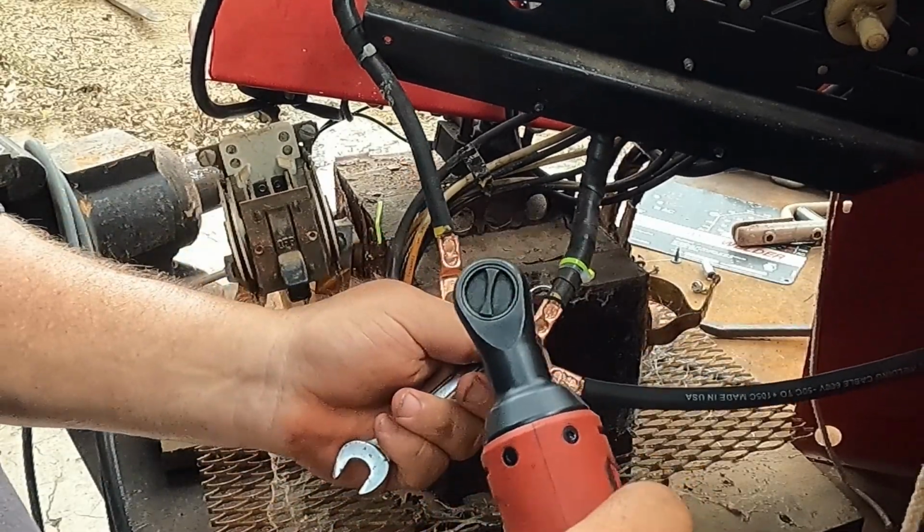Okay, so right here is the back of your DC AC power switch, and the negative is coming up to right here, and it ties in here and jumps across. So I do not want to be breaking this solder connection, so I'm going to make a mark right here. We're going to cut that, and then this is our hot, and this is coming up into right here, and a similar thing, kind of a shoved in soldered connection I don't want to mess with.